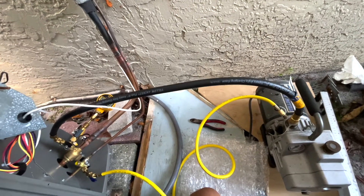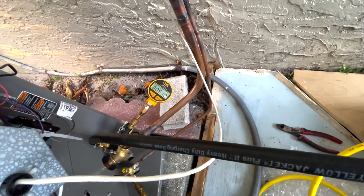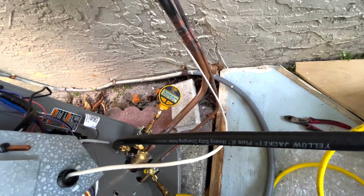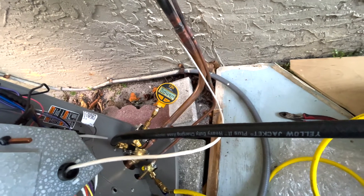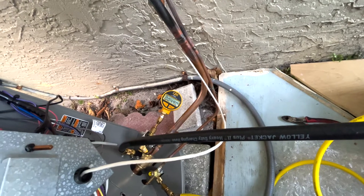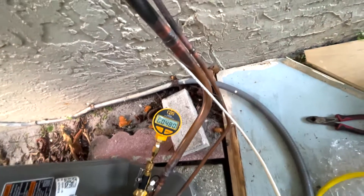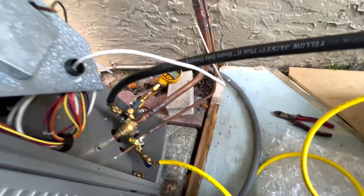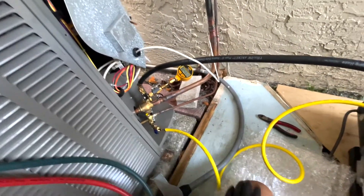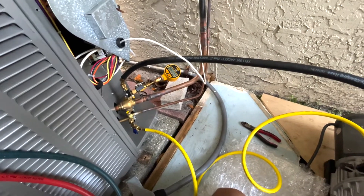It's been about 13 to 14 minutes and I'm already down to very close to 500 microns. I'm going to go deeper — 500 is the minimum you should have, but I'd like to pull anywhere from 200 to 300 microns just to leave some room. I'll wait a few more minutes and let it pull a little bit deeper, just in case there's any balancing needed on both sides.